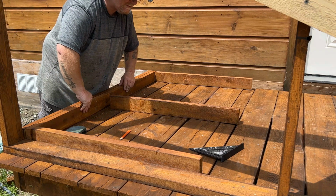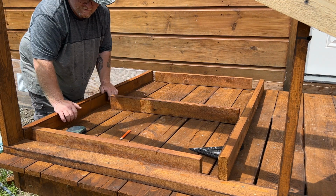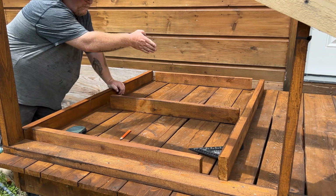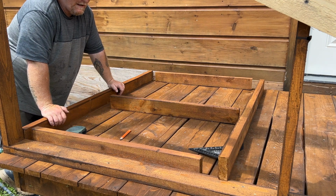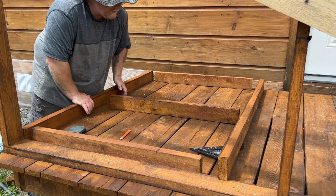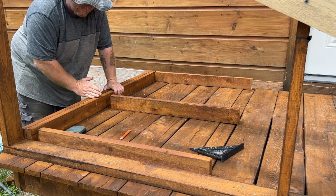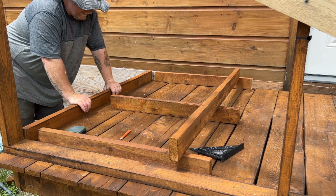Now the reason I do that on both the bottom and the top is so that when I take my top and I put it up at the top, when I go to nail in these 2x4 studs, they're lined up. Now on this, it's a small wall. I only have one piece here to line up, but the principle is the same. No matter how big your wall is, at least when I make my walls, I always mark the bottom plate and the top plate with my stud locations together. Then I take my top plate, move it up, and then I nail my wall.